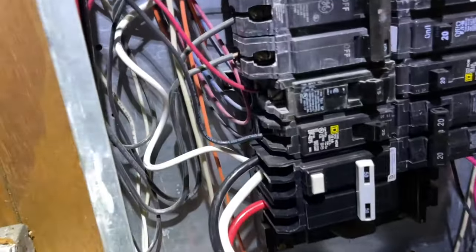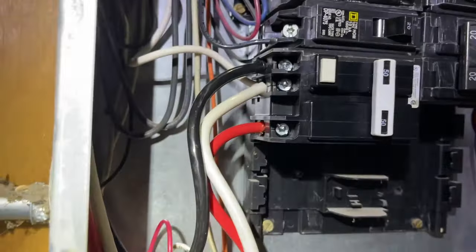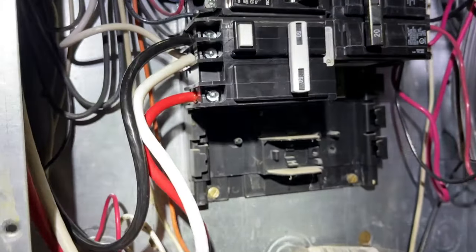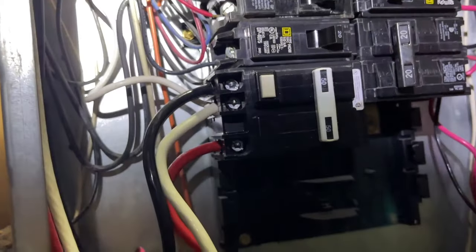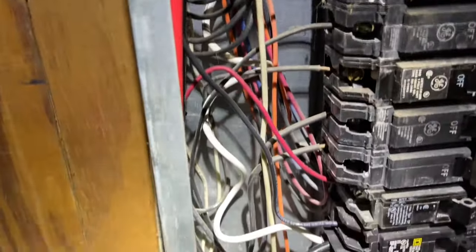Okay, it's a wrap. We're installed. Pretty good. I did these 30 inch pounds, 20 inch pounds initially, 30 inch pounds thereafter, and we ran good. I'm gonna keep the wires away from the screws. Ground is nice. And the neutral there out of the way. And yeah, we're gonna power up in a second.